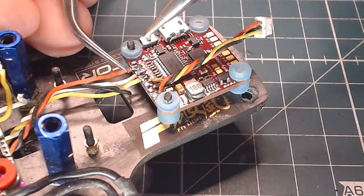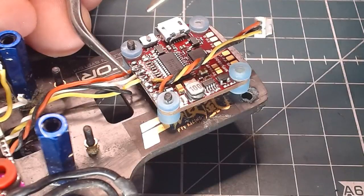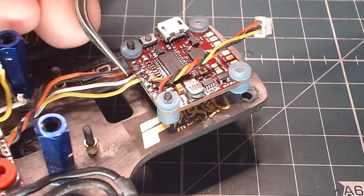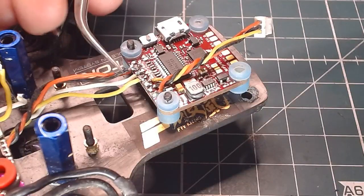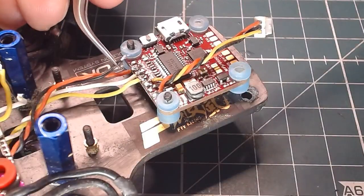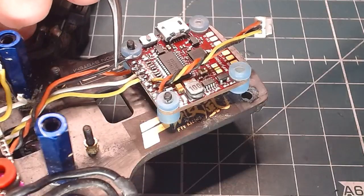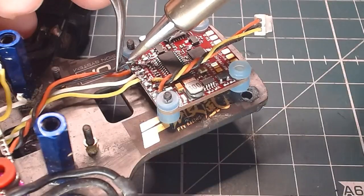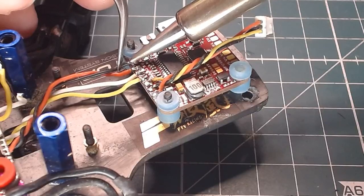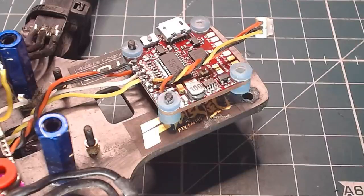The more mAh, the bigger the gas tank is one way to think about it. But it also does affect sag a little bit. A higher mAh battery will always resist sag better than a lower mAh battery. So yeah, I don't know. I would love for there to be like a 160 or hell, maybe even 150 gram 6S battery. Man, that would be amazing. It would bring the run times back down to 3 minutes, but that's where I like them. Going beyond 3 minutes, I get a little tired, not bored, but yeah, after 3 minutes, I want to come in and take a breath, basically.